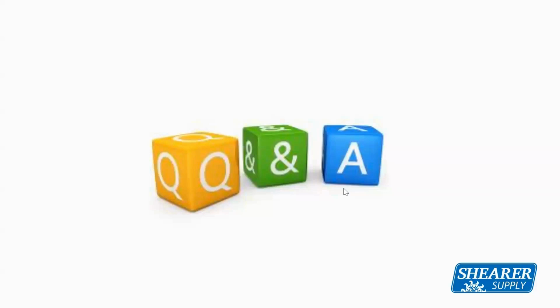What does AOC and MOC stand for? Honestly, I couldn't tell you. It has something to do with the computer boards on it. AOC is the smaller board. MOC is the larger board. How long does Y1 run until Y2? That decision is made by your thermostat. So whatever thermostat you're using or utilizing, that Y1, Y2 call will be determined by your thermostat.